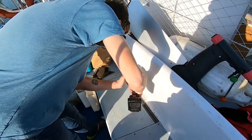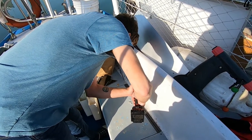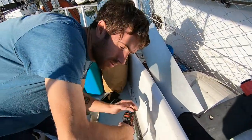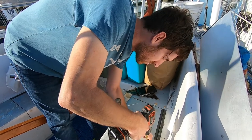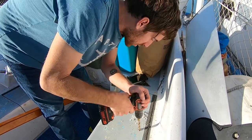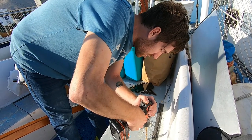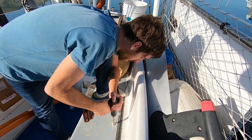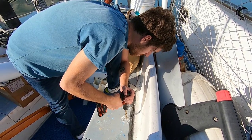Hopefully we don't need the extension, but if we need the extension for the autopilot then we'll have to move it and readjust it. We did all the measurements and wouldn't have had room for the extender. We should have a piece of wood or something under it so I don't splinter the back end. It's the weirdest thing ever, drilling holes in your boat — very strange and unnatural. Usually you're trying to seal holes up, not make them. Going really slow, I don't want to split the back end. It's about an inch of fiberglass — probably going through half an inch.